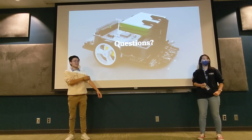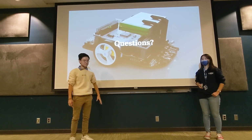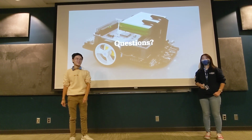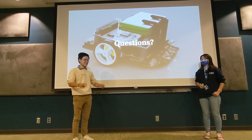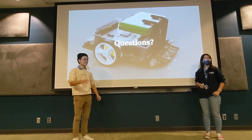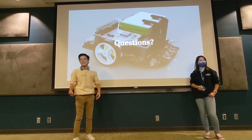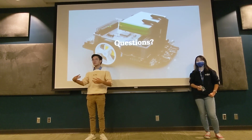What you'll see in the assignment is you will implement a really basic maze solving algorithm: if there's no wall in front of me, go one cell forward, and if there's a wall in front of me, turn in either direction. Turn right if there's no wall to the right of me, otherwise turn left. Only after completing each of these motions do we actually check the walls.